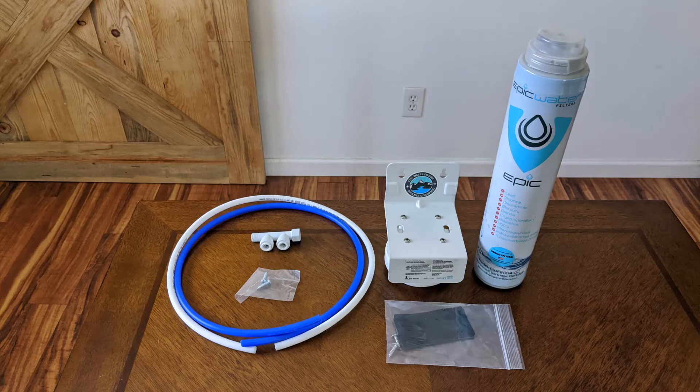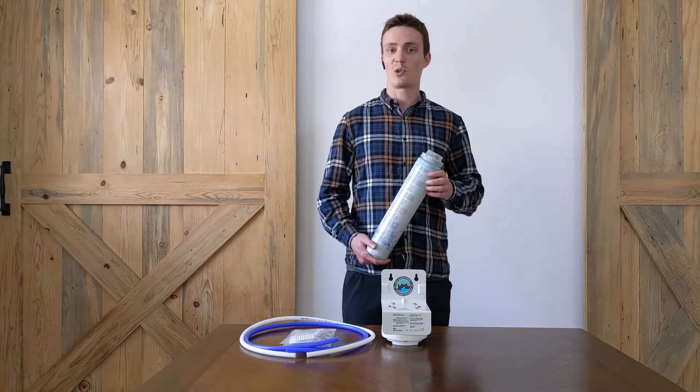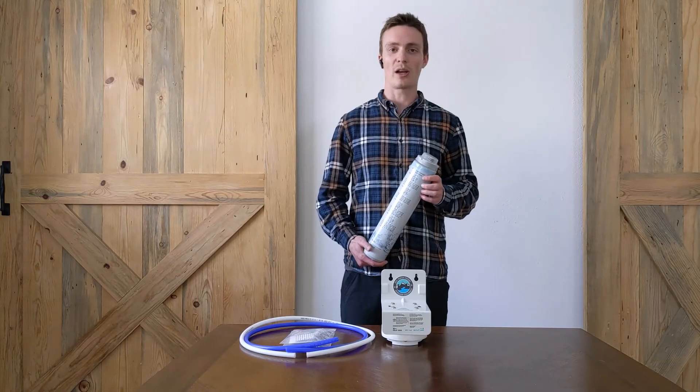To function properly you'll want your water pressure at a minimum of 40 to 60 psi, and the filter should last between 9 and 16 months depending on your usage. Next we have the cold water adapter and tubing — the white tubing connects to the outlet of the adapter and inlet of the system, and the blue tubing connects to the outlet of the system back up to the faucet water line. The system head unit attaches under your sink with screws or heavy duty velcro. It's made for easy DIY installation with no dedicated faucet needed — I'm assuming 10 to 15 minutes max to install.